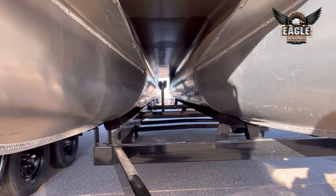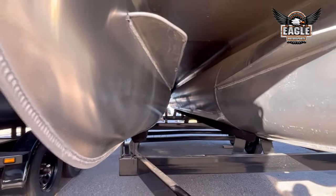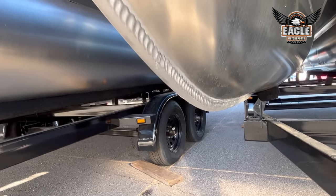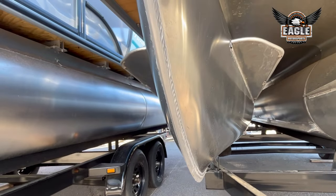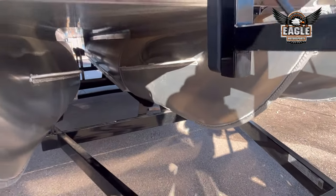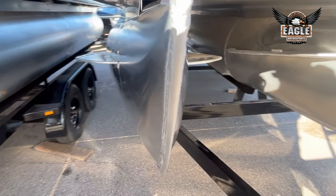You can see with the VM Custom Trailer, you have your guides. All of the toons are going to have your 5/8ths full solid keel, which is welded all the way throughout the toon. This is going to help with durability, so if you're beaching the unit, you're less likely to damage anything. Your pontoon gauge is going to be 080 wall — very high-quality aluminum.